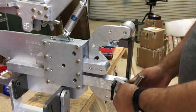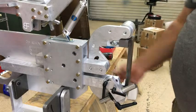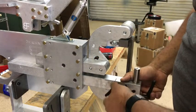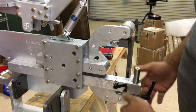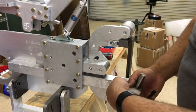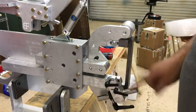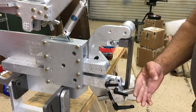Now you can use your rest and get whatever angle you want - adjust it to where it meets up the way you want it to, tighten it up. If we had a plate on here and wanted it on an angle, it's all right there. There's actually a vernier on here, so when everything's set up right you can control it to within one degree of your angle, and it works all the way up to over 60 degrees. You can also make your own custom work rest by getting some three-quarter inch shaft and bolting a plate up onto it.